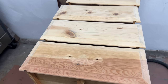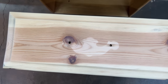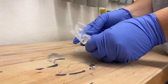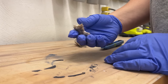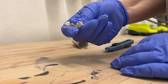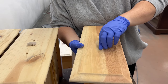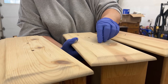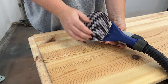Once I had all of the 80-grit done, I needed to fill in the old hardware holes. It's super common for this staining to happen under old hardware — it's just a natural process wood goes through when exposed to light, but it can be pretty tough to get rid of these ghost marks. I'm kind of crossing my fingers that my new finish and the new cup pulls I've ordered will hide those. I mixed up some QuickWood epoxy that comes in a tube with two colors of putty — you mix them together to cause it to harden. You only want to mix the amount you can work with in the next five minutes because it cures up really quickly. I rolled this into little snakes, dropped those into the holes, and stuffed it through until I had a nice solid fill, leaving just a little mound of excess on top to help me sand it flush to the drawer front.